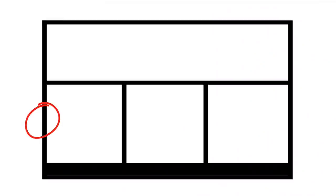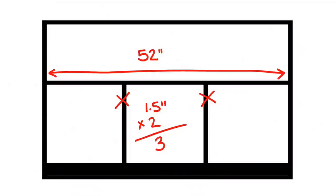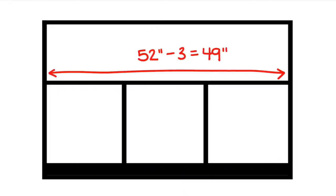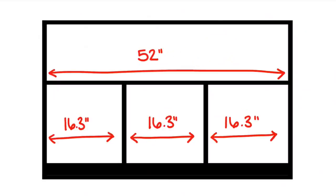I really liked the way it looked wide. I have small walls, so I decided to go with three spaces. Do you want end pieces? I have trim going around my doorways, so I didn't feel the need to put those pieces. But if you wanted them there, remember that's going to have to go into your math equation. So remember that measurement — 52 inches, that's how wide our wall is. We decided on three sections, so that's going to be two boards. The boards are one and a half inches wide; there's two of them, so that's three inches total. We're going to minus that from our total wall space. So 49 inches divided by three spaces — we get 16.3 inches. Each little spacing is going to be 16.3 inches, and that's how we know where to put our boards. I promise it's not a hard math equation.